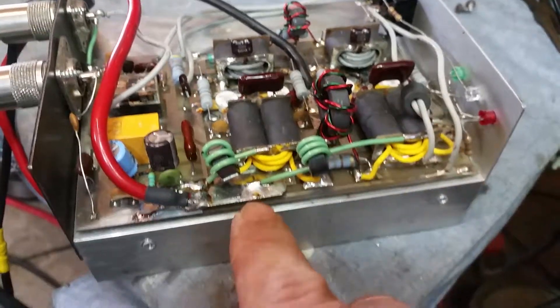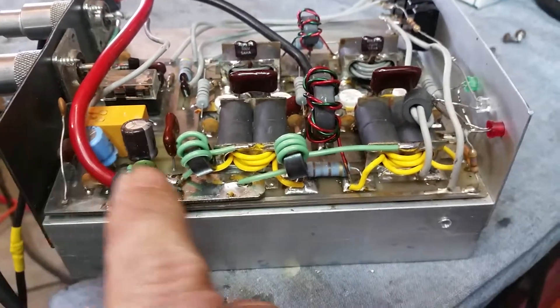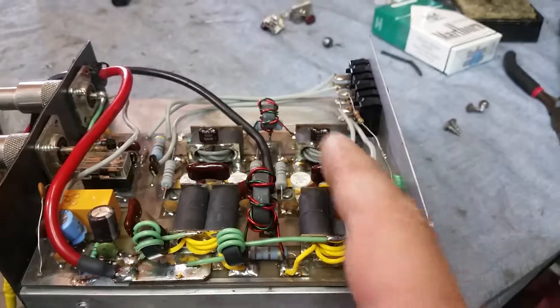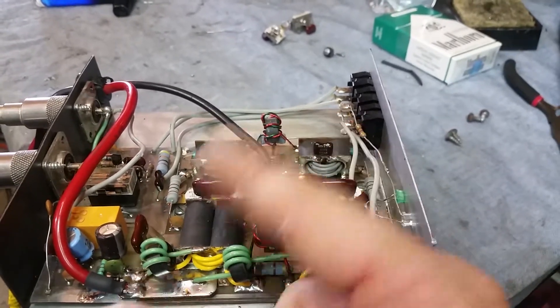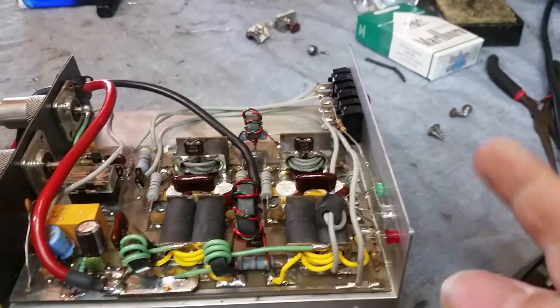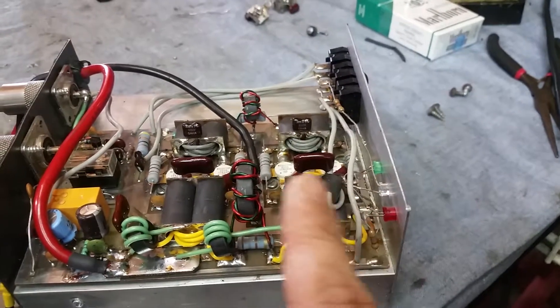What I did was unsolder the power wire, the diode, and the 104 cap, then mounted a piece of copper board right here. I brought the power wire over to the copper board, added another 104 cap and diode, and soldered the chokes to the power distribution board. Also, I don't like the way they ran this wire — it was sending power to the switches literally going over the whole circuit. I moved it to the back of the transformer, since you just need a tad bit of power for the LEDs, relays, and preamp.